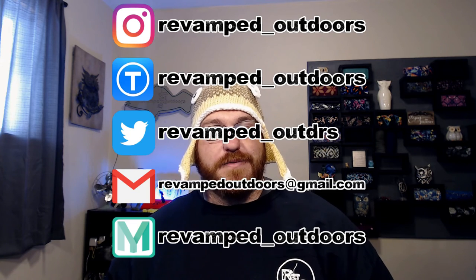So if it's something you're interested in, please leave a comment below. You can find me on Instagram and all the social networks. The first thing to think about is the electronics in association with the motor — there's going to be a lot of amp draw to that brushed motor and gearbox initially, then it'll even out. We have to come up with a circuit that can handle that, whether we stay with the buck converter or not. Ideally we'd have a switch capable of that many amps and of reversing polarity while maintaining the integrity of the battery pack and brushed motor. I'm going to need your help for that because I am not an electrician — just a guy with a 3D printer who thought it'd be cool to fabricate an ice auger from scratch.